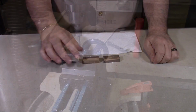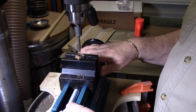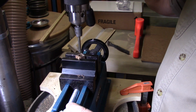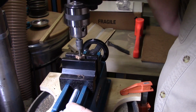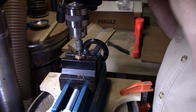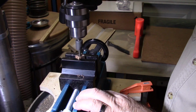Okay, so I've put my workpiece into the jig here for vertical drilling. Got my barrel trimmer mounted into my drill press and got it lined up so it goes right in there. So I can just start trimming this down until I see the shiny brass end on the tube there. Then I know I'm down there and square. As I said, slow and easy.